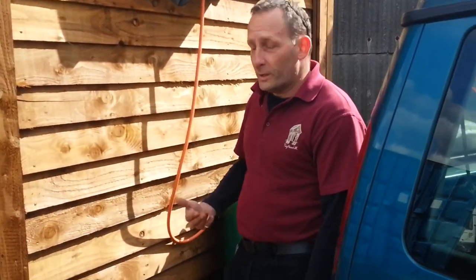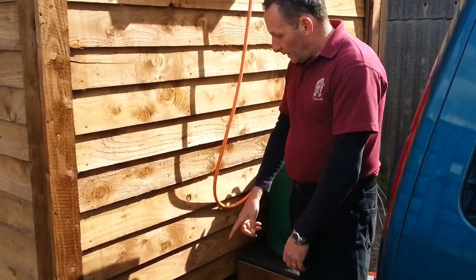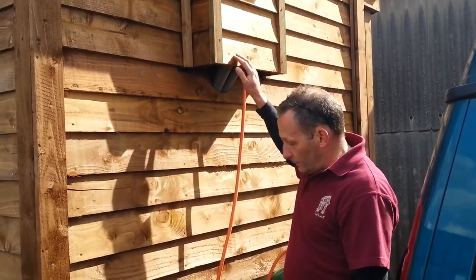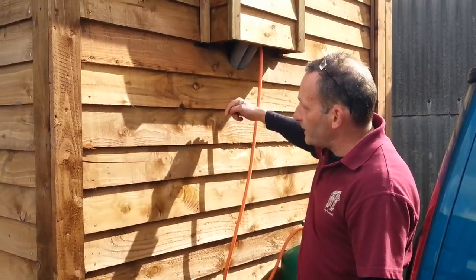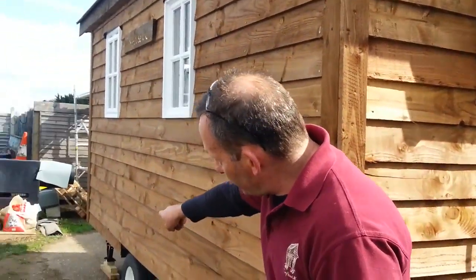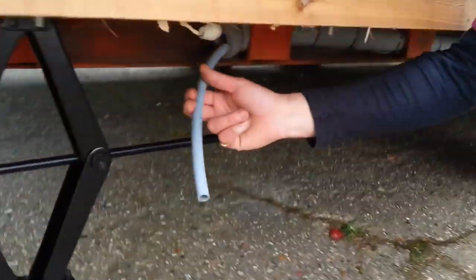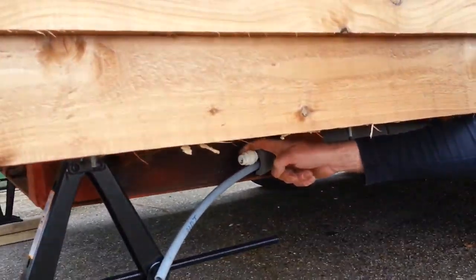The pump connects to a bucket or container, sucks the water up, and it goes through the shower unit. There's a tee-off — waste goes out the bottom. The water feeds up to the shower and also tees off out to the front for the kitchen — hot and cold underneath, ready for the kitchen connection. Everything is built bespoke. Alternatively, if this was going to be a static installation, there are further options.